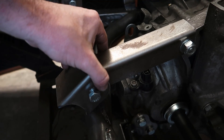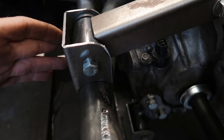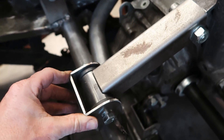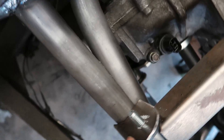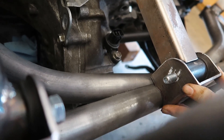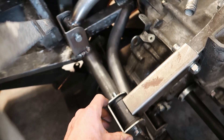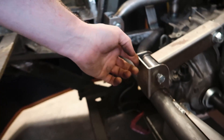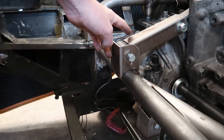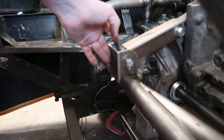We're doing a test fit so I can show you guys what we're working with. We've got really good gaps on each side, it fits the tubes really well, and the cope here is really nice. So everything fits well and we can weld the bottom of it. The only snag is we are not perfectly plumb on this bracket, so we're going to shorten this one just a touch — pull those copes on each side in — and we should be in business.